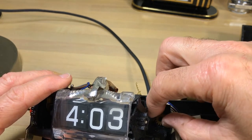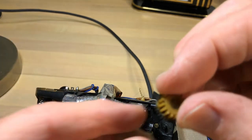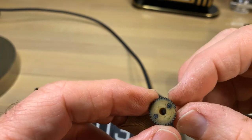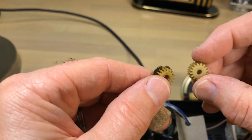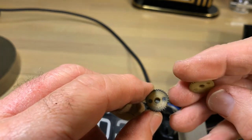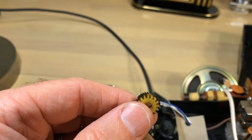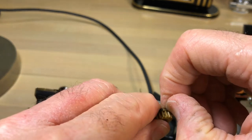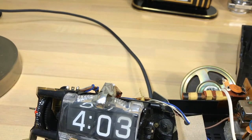There's no place holding that down - you just kind of pull that right off. Immediately I can see where somebody's gone in there and took a bite out of that gear - it's just about the size of the gear coming off the motor, so you've got brass versus plastic - often a problem with these clocks. I've got a parts clock and I've pulled the gear off that we need. It's pretty dirty but we're going to use lithium grease on that. Looking at it, it's not brittle at all. What likely happened is someone was trying to adjust the clock right in the middle of when it was trying to change time and it got jammed up.